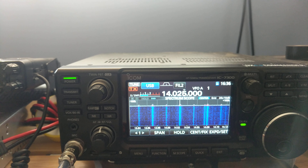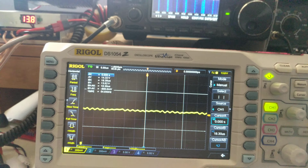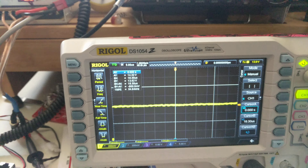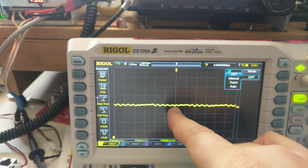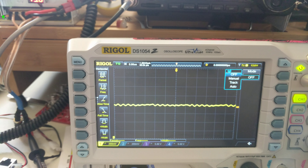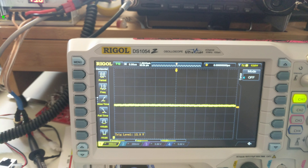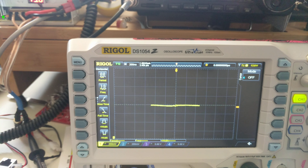Let's turn that down because that's annoying. Now I've hooked up my oscilloscope to the output of the power supply to show what's going on. This is zoomed in on the DC waveform coming out. And if I adjust the trigger just right, you can see a little bit of an extra blip sometimes — right there, that zigzag. That's the impulse we're looking for.